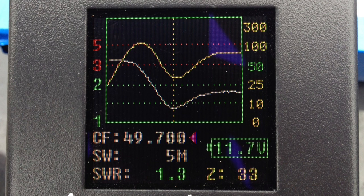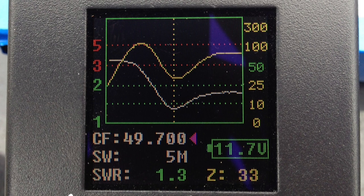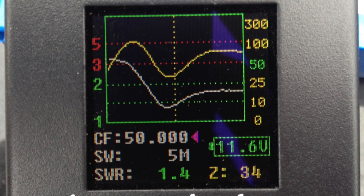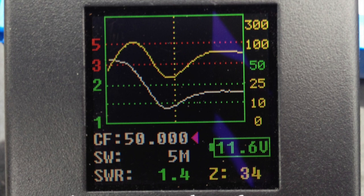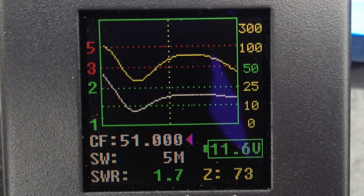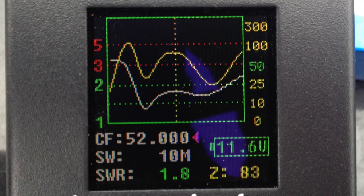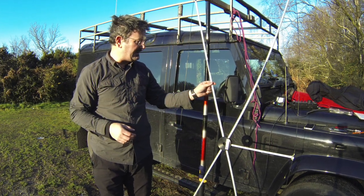Finally, let's look at the SWR. There's a dip just below 50 MHz at about 49.7 MHz where the SWR is about 1.3:1. At the bottom of the band at 50 MHz my SB6, as made without any tweaking or further adjustment, was about 1.4:1. At 51 MHz it was about 1.7:1 and at 52 MHz about 1.8:1. Once you get past that initial dip, the SWR and impedance remain reasonably flat at around 1.7:1 SWR and about 83 ohms impedance.